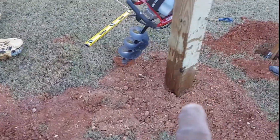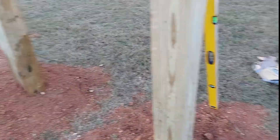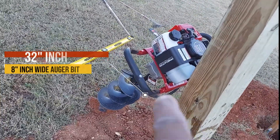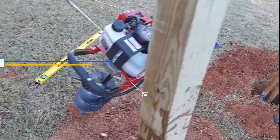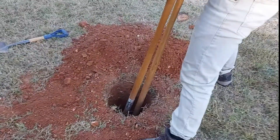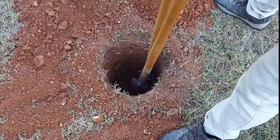Same with that one, and same with that one. For those of you who say it's only 18 inches in the ground — here's your auger. That's a 32-bit, eight inch in diameter. As we're digging it out, we've cleaned it out with a post hole digger. We try to go 40 inches in the ground.